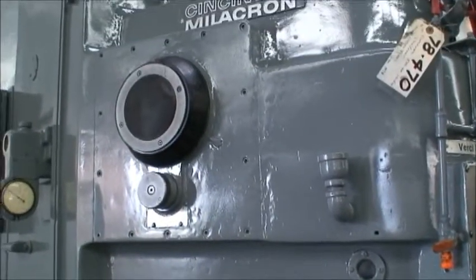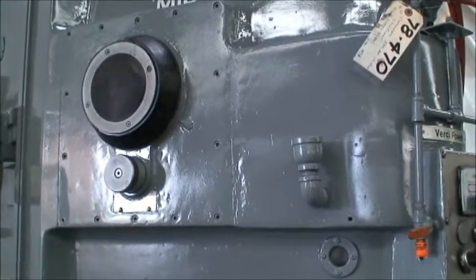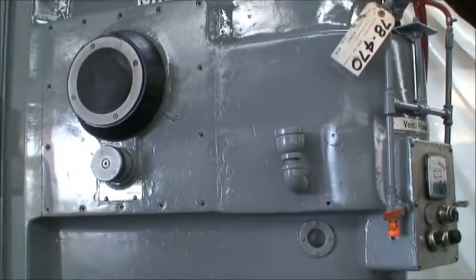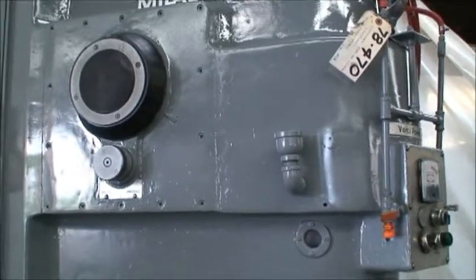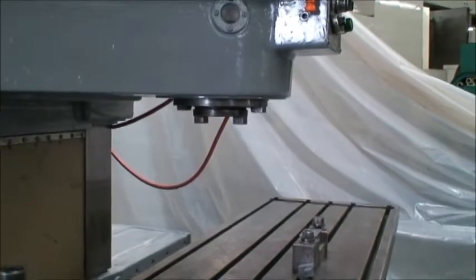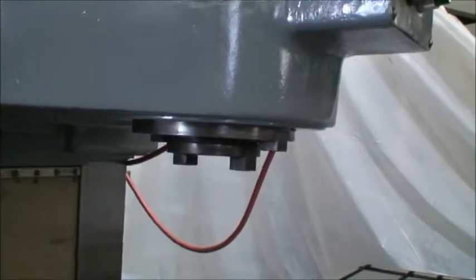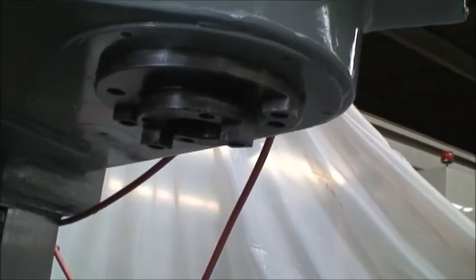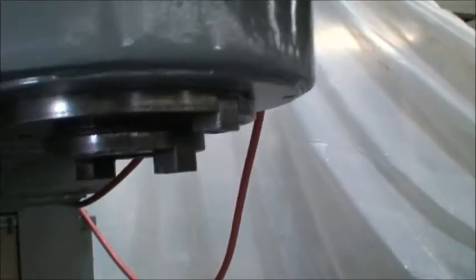Spindle speeds are shifted by power — power shifting of the speeds and the feeds. The spindle speeds are 14 to 1400 RPM, and the feed rate is 3/8 to 90 inches per minute with 150 inch per minute rapid traverse. It takes a number 50 tapered spindle with a number 60 flange, so if you have flange type tooling you can mount right to that.